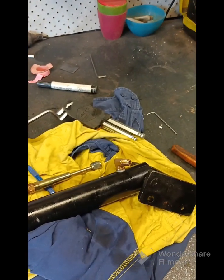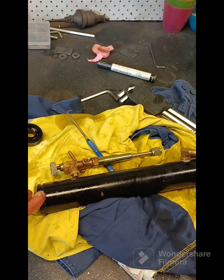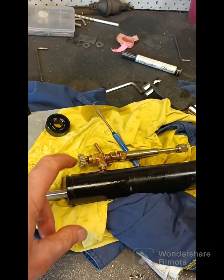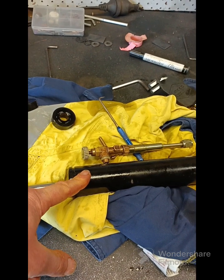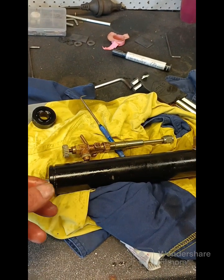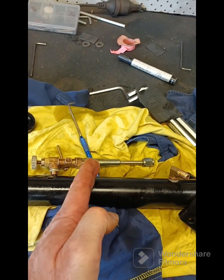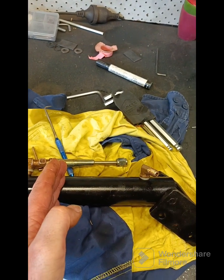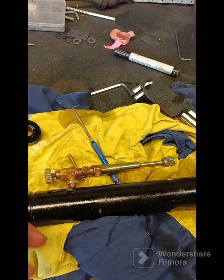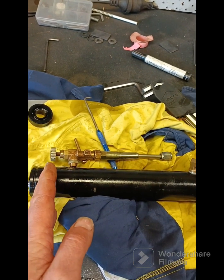Currently I've got a 36 - had I had a 35, something that was exactly the right size, I would have put it in. But having said that, I think the 36 might be better at springing out and keeping some tension against the bore. The piston's got a series of holes in it, it's tapered. When it's pushing down it pushes the o-ring up against that groove of the piston, seals off, and forces the oil through the tap. But when you pull it up, the o-ring will simply drop down.